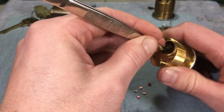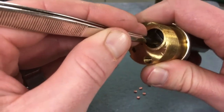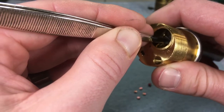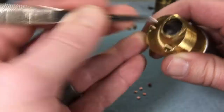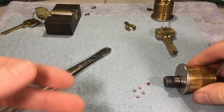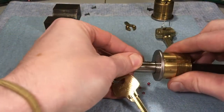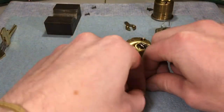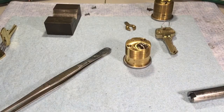That's why we're holding it upside down — because gravity isn't able to pull those pins down. So we're really giving the spring its money's worth to make sure it's working. I can let them press up and down and see that they're working, and then as I go through it make sure everything's as it should be. Then it's either been pinned correctly or it hasn't, and you just reassemble, dump these pins, and you're good to go. So that's one method — the slow method.